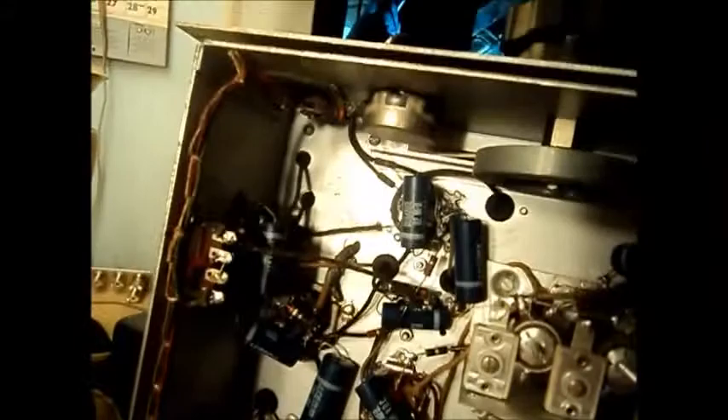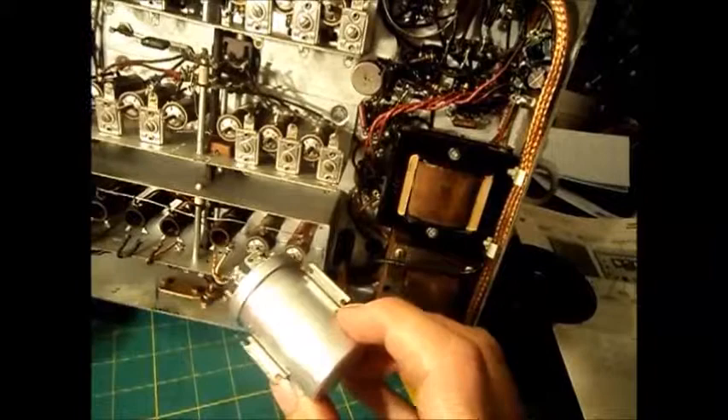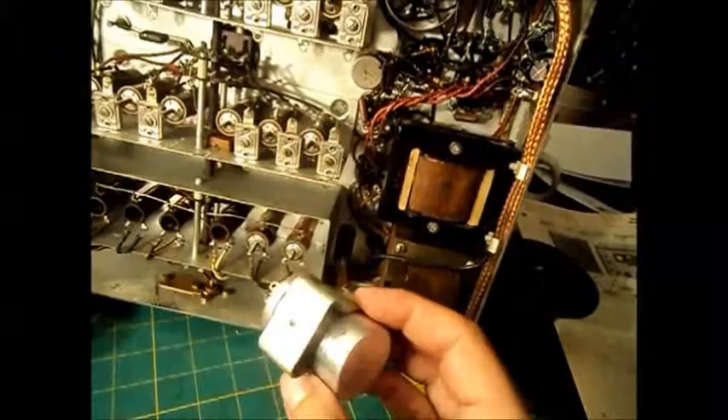This corner was the most difficult one. A lot of these were buried — some way down in here. The safety cap goes from the on-off switch down to ground. I did look at this can and thought about recapping it, but it would be difficult to get this open cleanly. I could cut it and tape it, but it's not very large and it would have been tight getting all the new caps in it. So I elected to just unscrew it and put a terminal strip in.